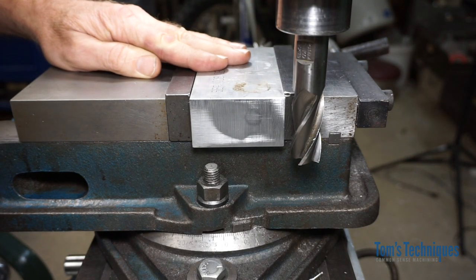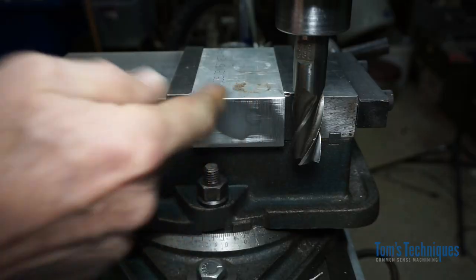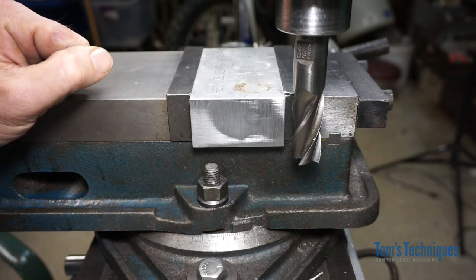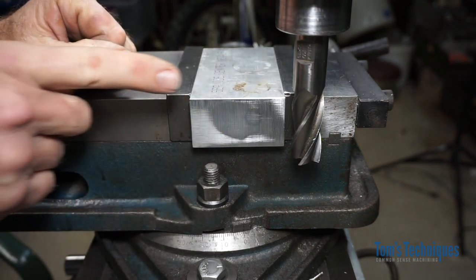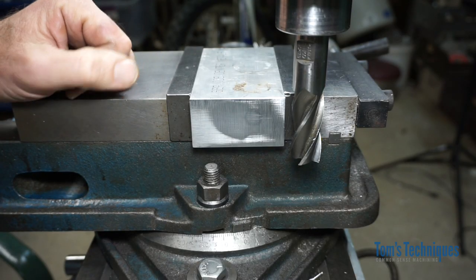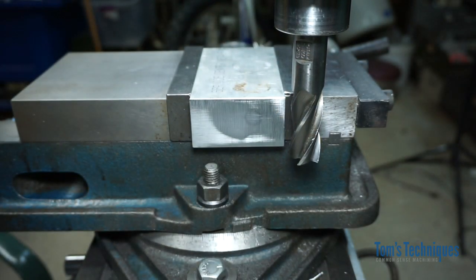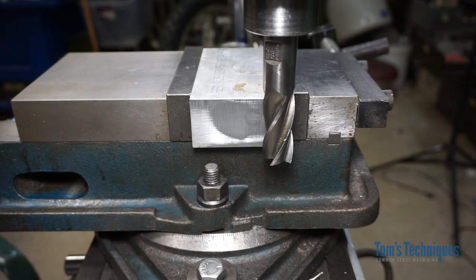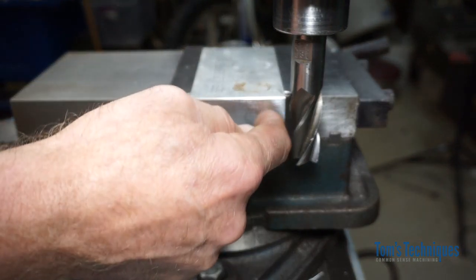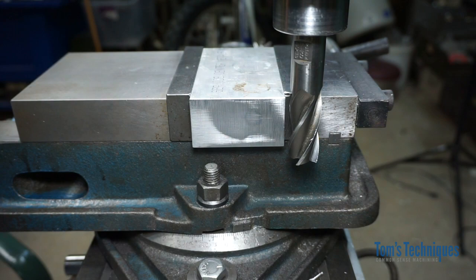Here I have a piece of aluminum bar. Let's say I want to side mill the end of this bar — it's just a belt-sanded surface and I want to machine it nice and precise. There are two ways I can go about it: I could climb mill it or I could conventional mill it. Climb milling is when you feed the work against the cutter in the direction of rotation. In this case the cutter is rotating clockwise, so if I feed my work in the direction of rotation, the cutter is going to want to climb up on the surface — that's where the term comes from.